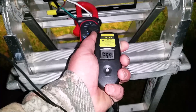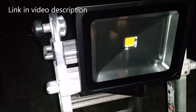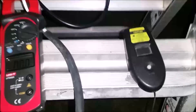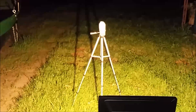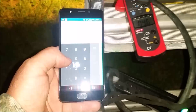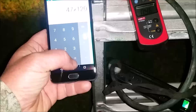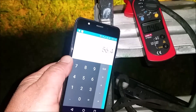Here we have the LEDMO — 50-watt from Amazon.com, $26.99. One lux meter 60 inches away, one camera to zoom in on the lux meter, one amp meter, and an infrared thermometer. Our amp reading is 0.47. Let me do the math: 0.47 times 120 equals 56.4 — so this 50-watt light is actually a 56.4-watt light.